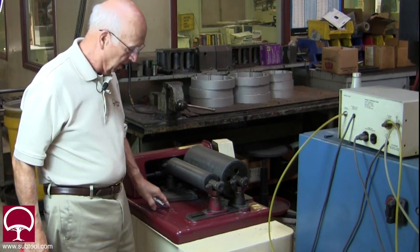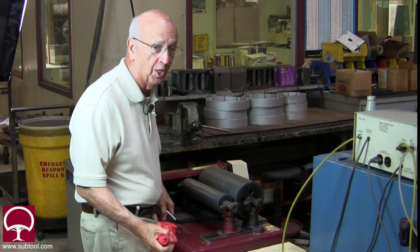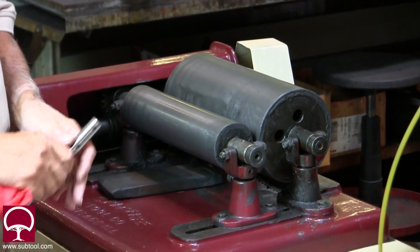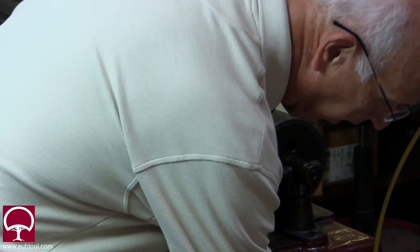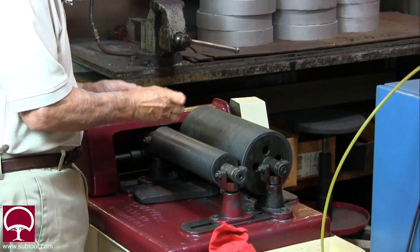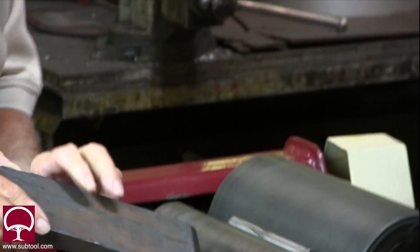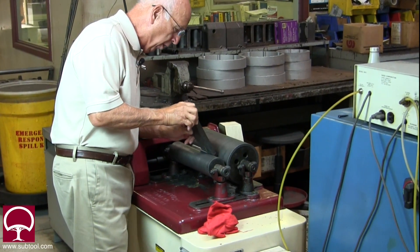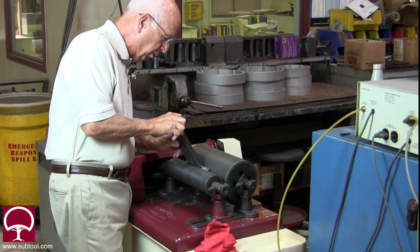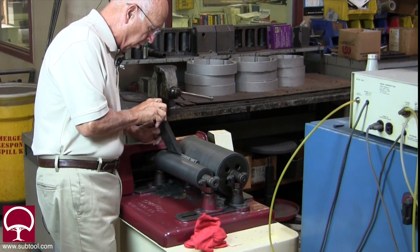This is the Spitfire — that's the name of our machine. It was made in Chicago, probably 150 years ago, but it still works great. It has two cast iron rollers of different sizes and runs at a relatively low, adjustable speed. You drop the part on there, take a wooden stick — pretty ingenious — and move it back and forth. Then put some compound on it, add some mineral spirits, and you end up with a lapped roll.